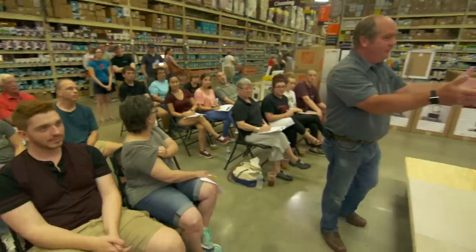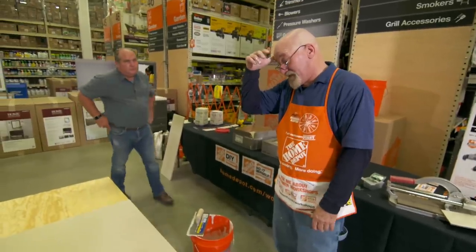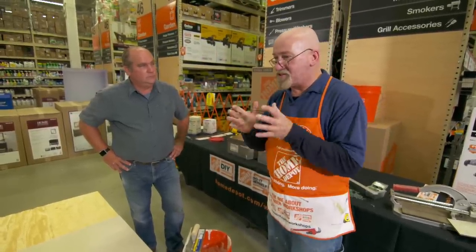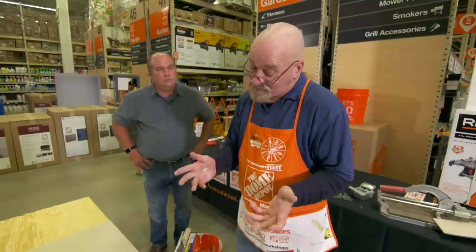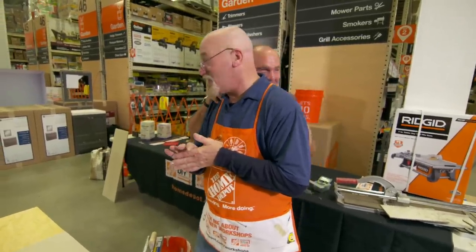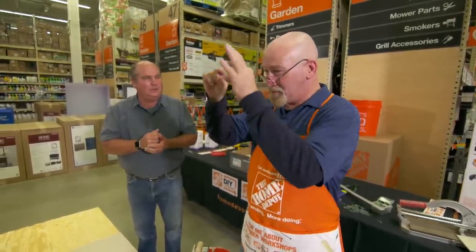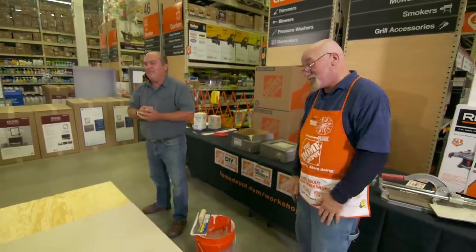Question: how do you fix a mistake? It does happen. Matt tiled professionally and once got halfway through a floor and realized he started from the wrong perspective — he had to get a floor chipper and pull them all up. If it's just one bad tile, you basically smash it, take it out, scrape everything down to the substrate, and try to get a new one in. Matt also confessed that in his own 100-year-old house bathroom with glass tile, two tiny tiles are angled just slightly — and they drive him crazy every day.